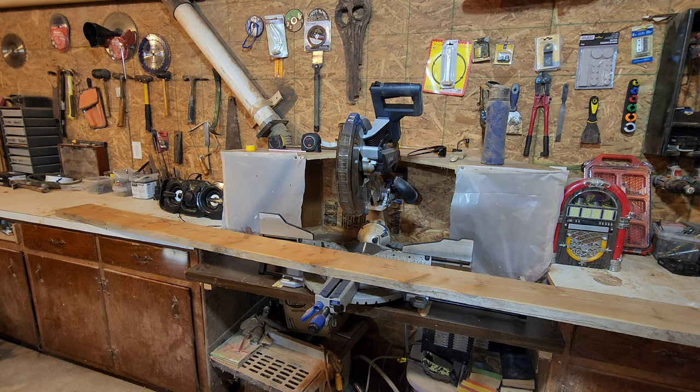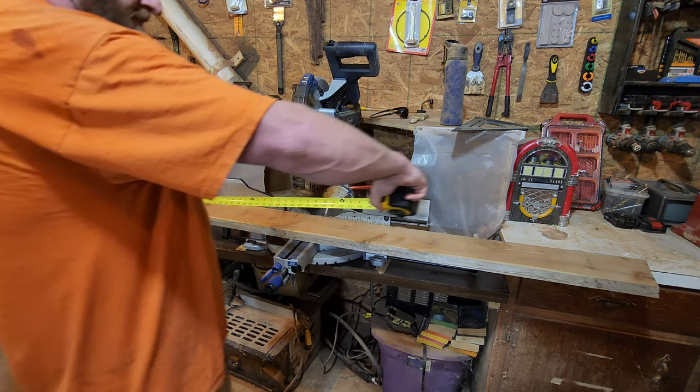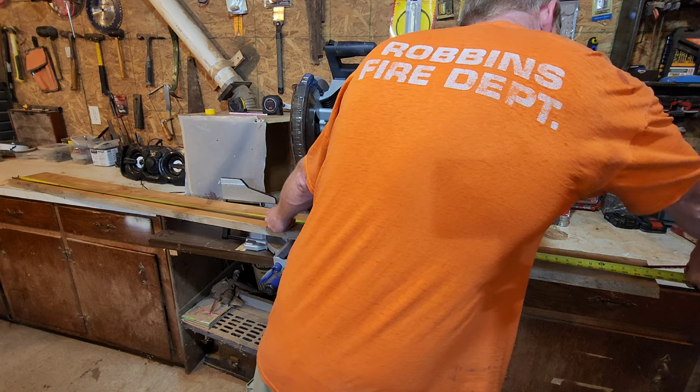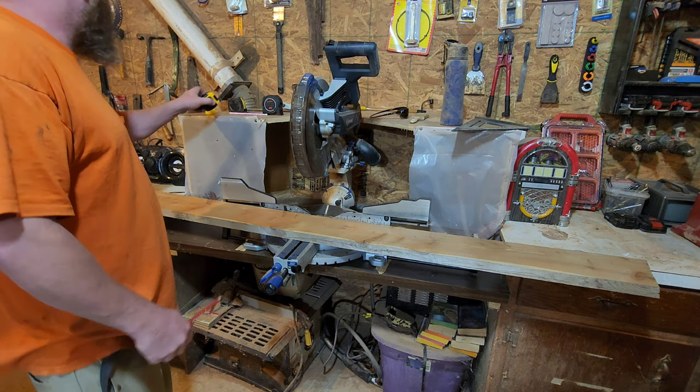The way I do my armrest and everything, you get whatever I call the swing, 4, 5, 6, 7 foot, whatever. I have to be a 4 footer, so when I cut these seat slats, they're going to be exactly 4 foot long. A ruler, and see what we're going to get out of this one. This is 8'5", so we can get 2 4-foot slats out of here.